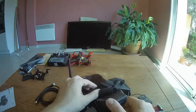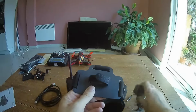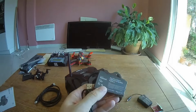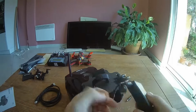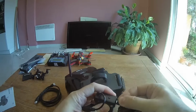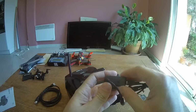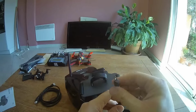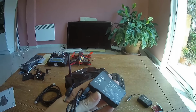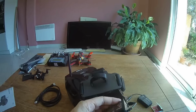You have a good head strap where behind you can strap one of the two batteries provided. They are 1000 mAh 2S LiPo, and good news, you just need to power them through the micro USB plug like this, and you have a power capacity indicator. Okay, 3 LEDs means it's fully charged. It ends with a classic DC connector. You need 1 hour and a half to charge them, and with one, you have 1 hour and 10 minutes